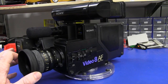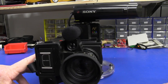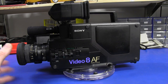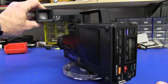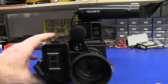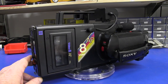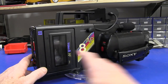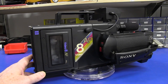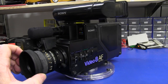It's got a 250K CCD image sensor, autofocus — that's probably all the autofocus sensor up there — and a built-in boom mic. These cameras back in the day had no LCD; you got a little CRT viewfinder. You've seen people walking around with these things on their shoulders in old news footage and home videos. So this was pretty much state of the art in 1985, and it is a world first to support the analog Video 8 format — not the more recent digital versions.